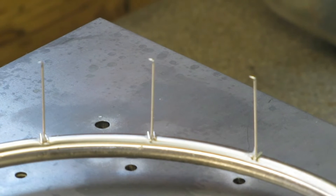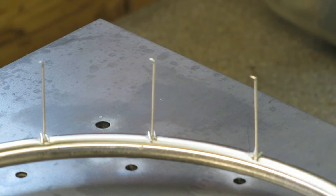Let's see if I can put all the syringes in vertical, put the flux around each hole and some silver solder. What I'm trying to do now is just heat the whole unit and then I'll get the oxy propane torch on them. I'm just trying to do it as tidily and neatly as possible. I find heating the whole volume just makes it easier because you don't have to put so much direct heat on at one go.